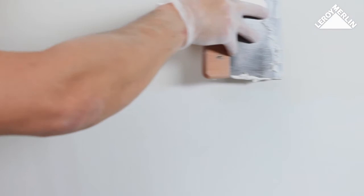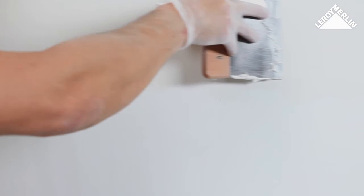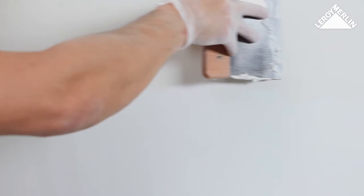This time you will have to go over the work several times to achieve a perfectly smooth finish. You could also use a decorative skim. Once the first layer is dry, sanded, and dusted, apply the next coat in horizontal strips. If other layers are necessary, work in alternate directions each time you add one. Once the walls are perfectly smooth and dust free, paint them any color you like.